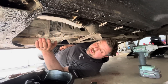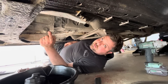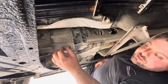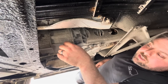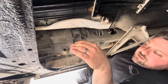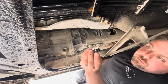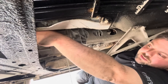If you're doing this in your driveway, make sure you've got axle stands in place — I'm perfectly safe under here. Before you drain your gearbox fluid, make sure you can loosen the filler plug first. I've seen so many people drain a gearbox and then be unable to fill it. I've cracked both loose — this one's your drain, this one's your filler. The drain plug has a little magnet on it to pick up any metal shards. There are a couple of wee bits on it but nothing excessive — looks like normal gear wear.